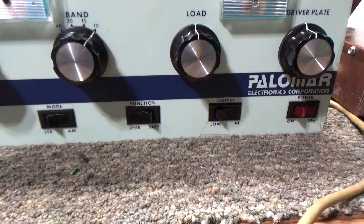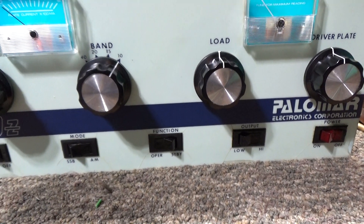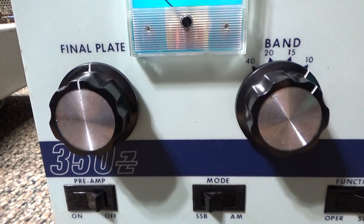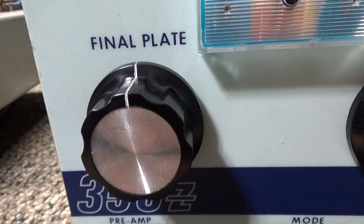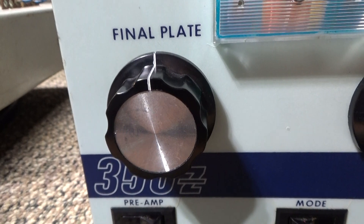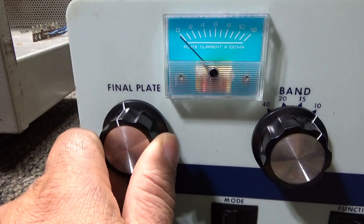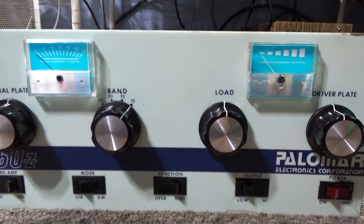Black Cats aren't quite normal — most amps are more like the 350Z, especially amps with driver tubes. When you're going to tune, get your wattmeter, key it down, drive it with the correct drive. Most CB amps are made for four watts drive or less — two to three watts probably works a little better on most of them. If you don't know where the tuners are normally set, start with all your tuners halfway — halfway, halfway, and halfway. That's a good place to start.